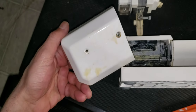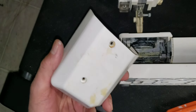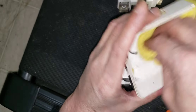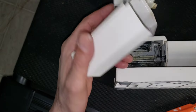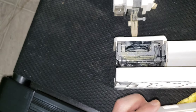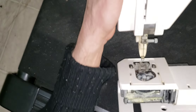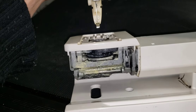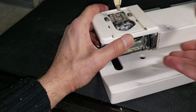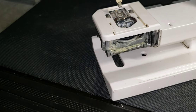It's always best to use sewing machine lubricant — it works best. But if you don't have it, you can use grease. If the machine is really stuck, first clean it and then use WD-40 to loosen any stuck or locked joints. Then once it's loose and free to rotate, you can use grease to grease it up all over, or you can use a spray grease can, which I will show you in this video.